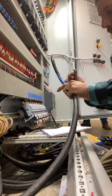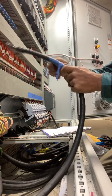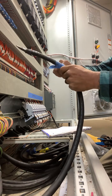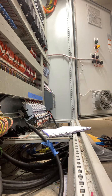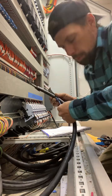Something ain't jiving — that's when the unit broke off. Take the last joint loose where you're at with the unit on it. Take that joint loose at the unit — the MC whip for the unit — and leave everything else connected, see if we get power to hold down the run. Because that unit could be wired up wrong. I told you he went and cut the tags off and just went to doing what he wanted, like a big dummy.